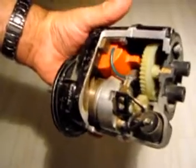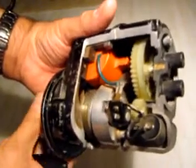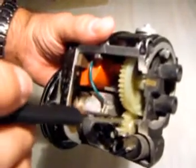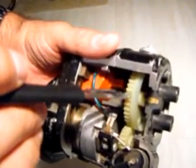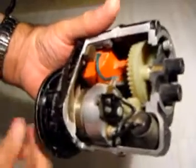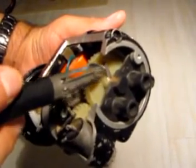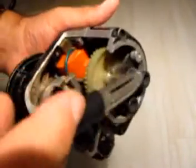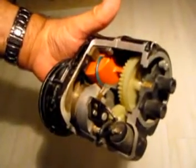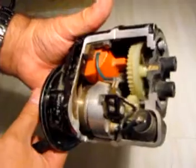So briefly, that's what's going on. Let's turn it some more. There is no electrical connection across the small and large nylon wheels. The small wheel is turning the large wheel, and all the large wheel is doing is taking the high voltage pulse of electricity and taking it out through this finger to one of the four high tension, high voltage leads and then out to a spark plug. No battery required. We're just generating high voltage for the spark plug through mechanical means only.